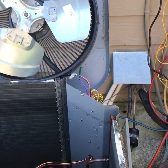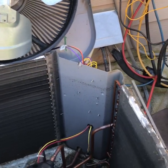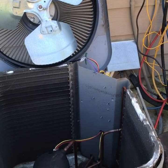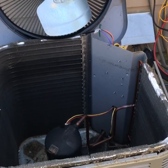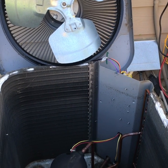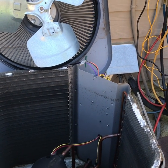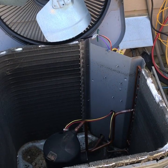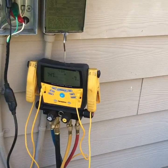While the vacuum is running we can put this unit back together. When you're pulling a vacuum on a system with your valves open pulling from the compressor, it's very very hard to get it to 500 microns. Around 600 is usually where I get to and that can sometimes take 45 minutes to an hour. Trying to get to 500 on an open system pulling into the compressor is almost impossible, but if you can get it to 600 or start dropping below that, there's no leak and it's going to be fine.